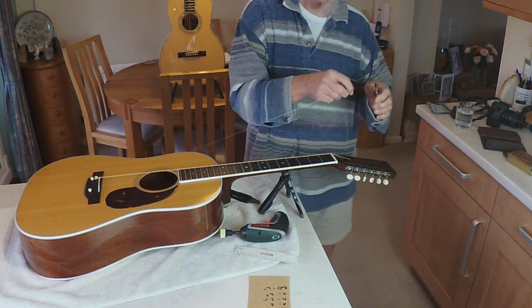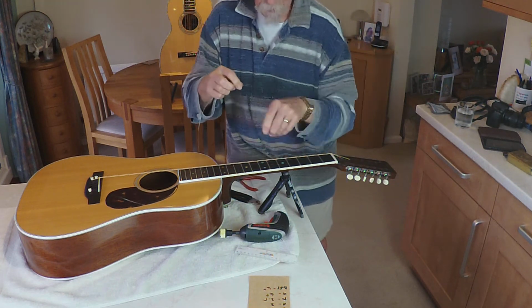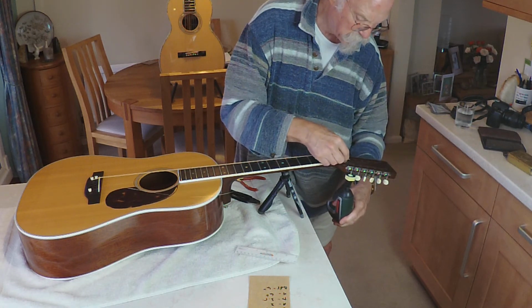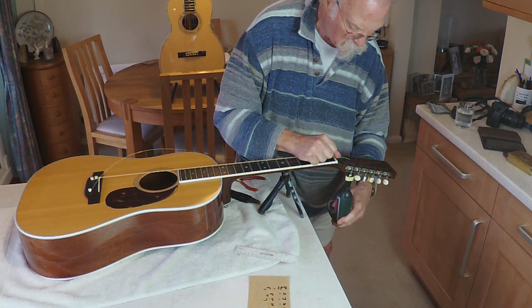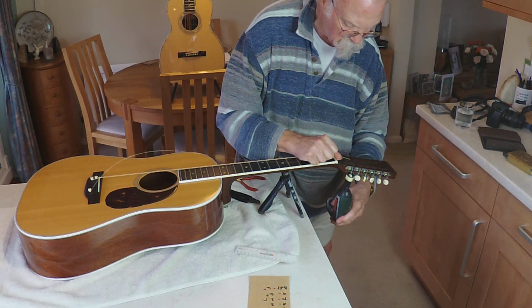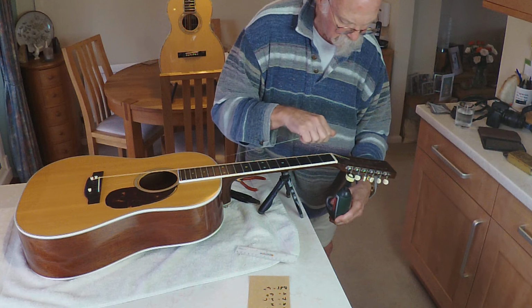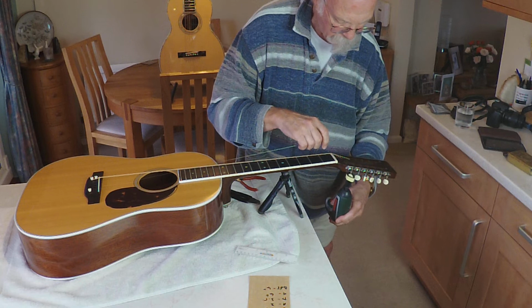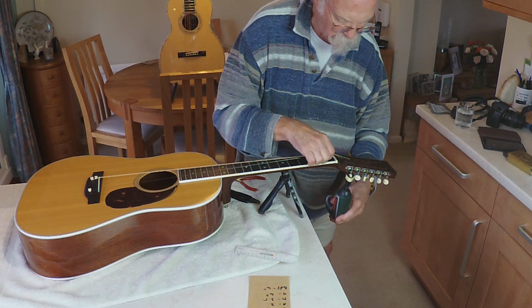Again, 1/4 inch, 90-degree bend, so it just plops into the hole on the capstan. A capstan is what I call the barrel of the winder. Again, 1 roll on the inside of the headstock, and then we take this to the outside. Try and wind that as nicely and tidy as you can, but there is room for adjustment later. There we go. We've got 4 inches to wind up here.